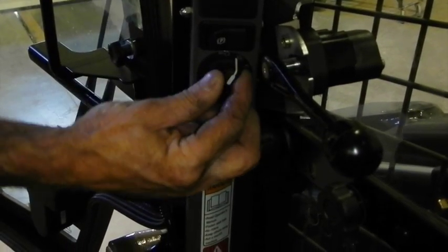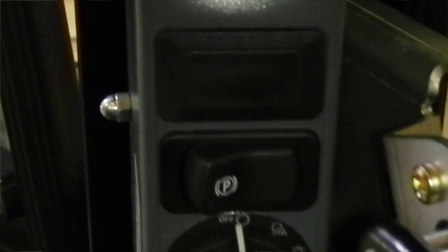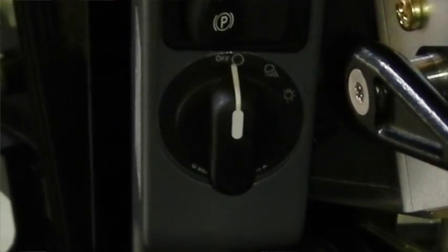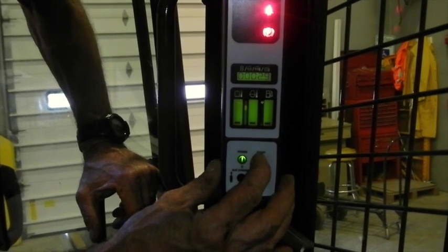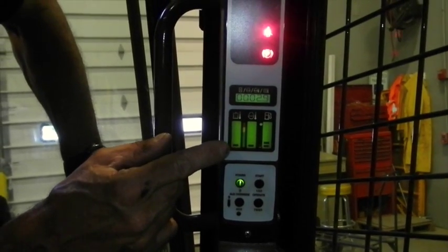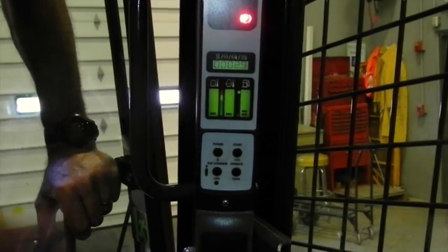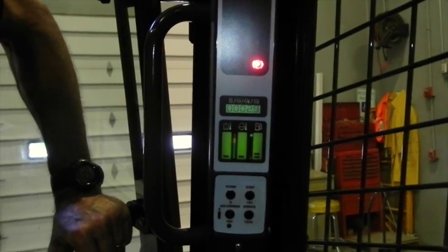The next switch below that is your light switch, which is for headlights and running lights. This next switch is for your parking brake — say you stop and want to set the brake but don't want to get out of the seat right away. If you do get out of the seat, the parking brake automatically goes on, but this switch allows you to set the brake without getting out. This four-button pad: to start the machine, hit power first, then hit start and the engine will start up. In order for anything to function, you'd hit operate. If you had a function like a water pump and wanted the machine to run without you being in it, you could hit the auxiliary button to enable the auxiliary hydraulics to run without being in the seat. These are also your sight glass readings for hydraulic temperature, water temperature, and your fuel gauge levels. Above that is your hour meter, and these are your warning lights for any function that might be going bad.